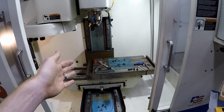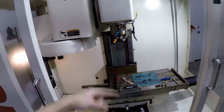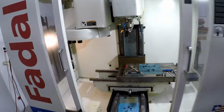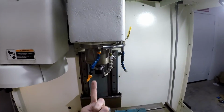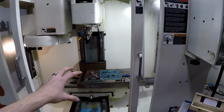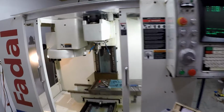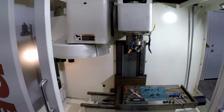Hopefully we're straight. Next video, we're probably going to be checking axes. We're going to check X, Y, Z. When I bought this machine, when I was at the shop that I bought it from, they had the whole machine loaded on a pallet, which you might have seen in the delivery video. But when I was at that shop, the Z-axis had about 3 thou of backlash. So I'm gonna reconfirm all those numbers that I did, or check. We'll probably get into this guy a little bit and see backlash comp and see if we can get anything to zero out or go closer to 0. I really don't want to have to replace the ball screw, but if I have to, I'll do it. So yeah, that's next up.